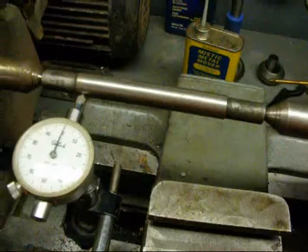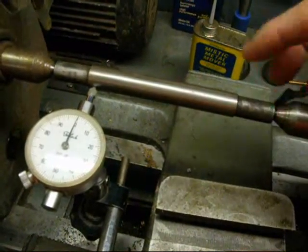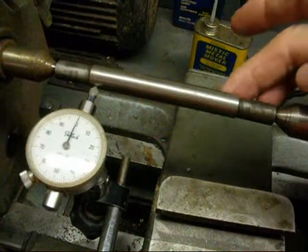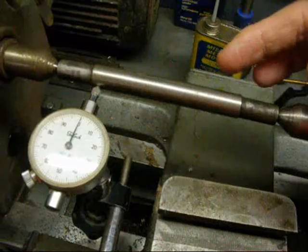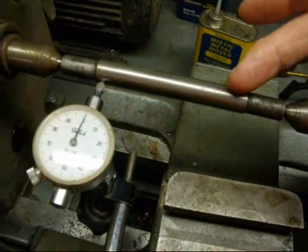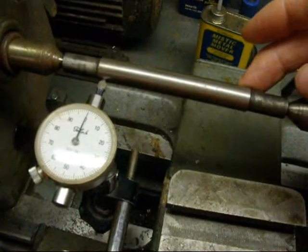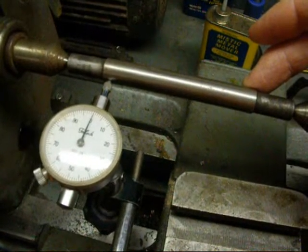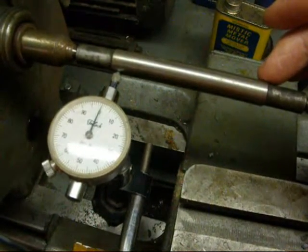What I'm using here is a lathe mandrel or lathe arbor with center holes — it is hardened and ground, and this is a half-inch diameter. The only issue is I'm really working against myself because an arbor does have about a half-thousandth to one-thousandth taper on it, so you could press this on work and turn between centers. But I'm getting a point across by using this. You can buy these real ground arbors on eBay, but they are a hundred dollars and something you only use once every few years — so borrow one, or wait and use the next method I'm going to show you.